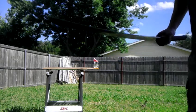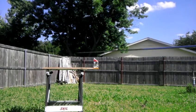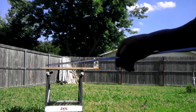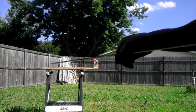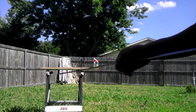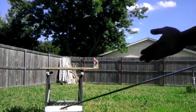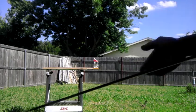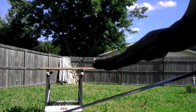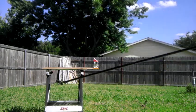The reason why I can slide through that is because obviously the edge is really sharp. The other thing is any excess convex is removed from the edge, so basically there's just the edge there. It doesn't push the bottle when I slide through it — it allows the edge to work. It opens the edge up, allows it to slice. By removing the convex, it's not pushing against the bottle, therefore my target is more static.